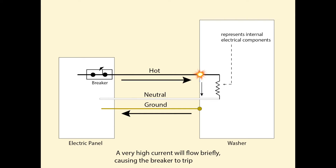Through the ground wire, a high current runs back to the breaker panel — a current many times higher than the rated amperage of the breaker protecting the washing machine. So that breaker immediately trips and kills the power to the washing machine. Now if somebody were to walk up to it, they're no longer in danger of being electrocuted. Obviously the washing machine can't be used because the breaker's tripped, but at least nobody's going to get electrocuted.